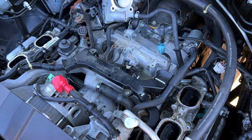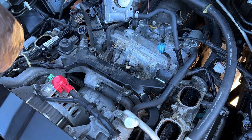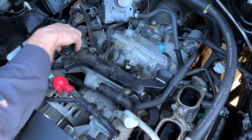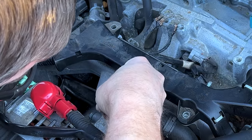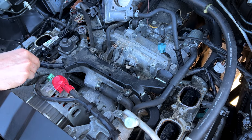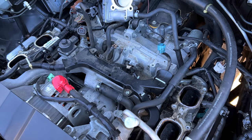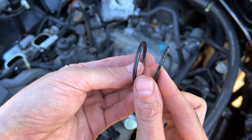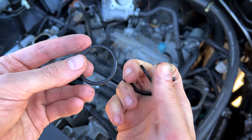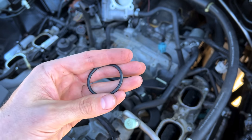These O-rings are just completely flat, so no wonder they were leaking. And with the cold snap we got this week — and by cold snap I mean seven degrees here in the south, which is a cold snap for us — that might have been enough to get them shrunk down and shriveled enough to just start to go ahead and leak. All right, first O-ring is out. What a world of difference between what we just removed and the new one — just breaking apart where it should be nice and squishy and pliable, this one is done for. So we'll go ahead and put the new ones in there and torque that back down.